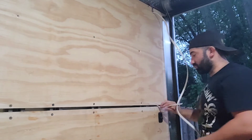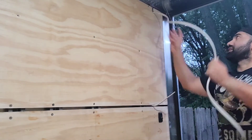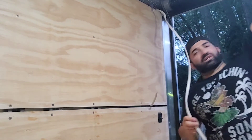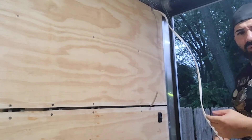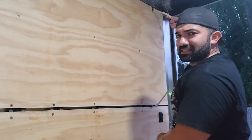That's going to give you, for your four outlets, a double outlet right here. Then this wiring we're going to run right on top of the roof, stop at the light in the middle, and then take it into the breaker panel. That's going to be what we call a home run. Let's get that set up now.